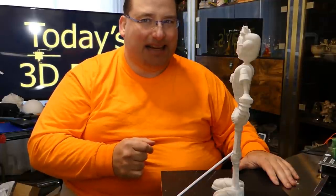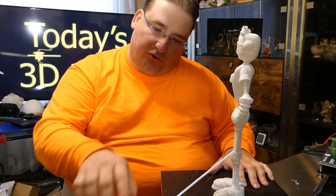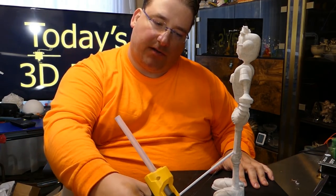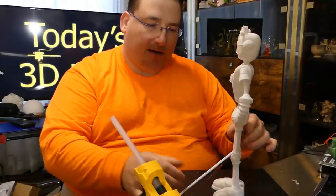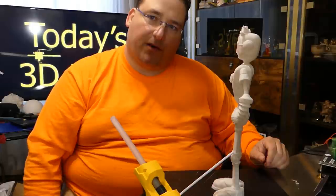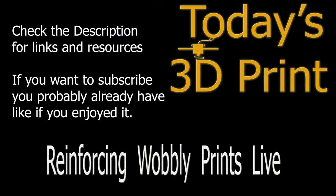And if you're printing at 100°C, you might have trouble getting the hot glue to actually cool. I'm not sure what temperature it melts at, but I'm pretty sure it's over 100°C — though it's probably close enough to be soft at 100°C. But for PLA temperatures, you'll be fine. And that is a way for you to add a level of rigidity to your models so that you don't lose your prints on very long, very large prints. Hope you guys enjoyed that. Thank you.